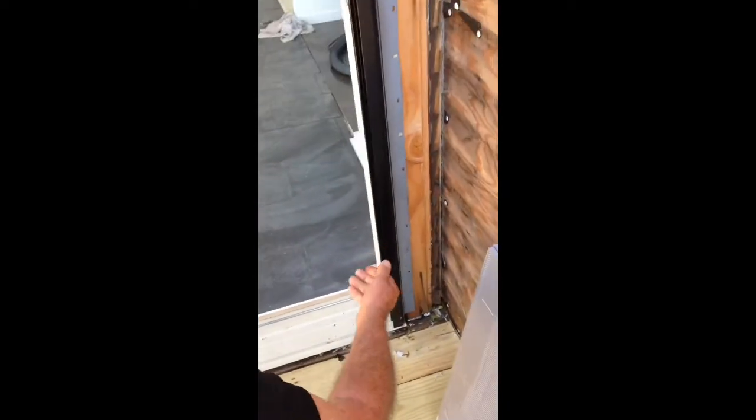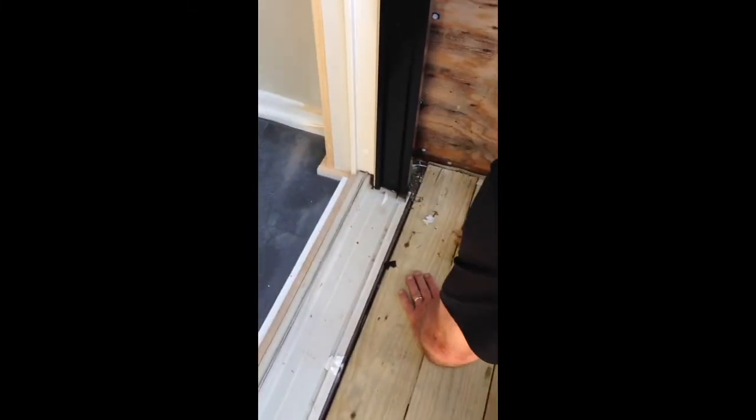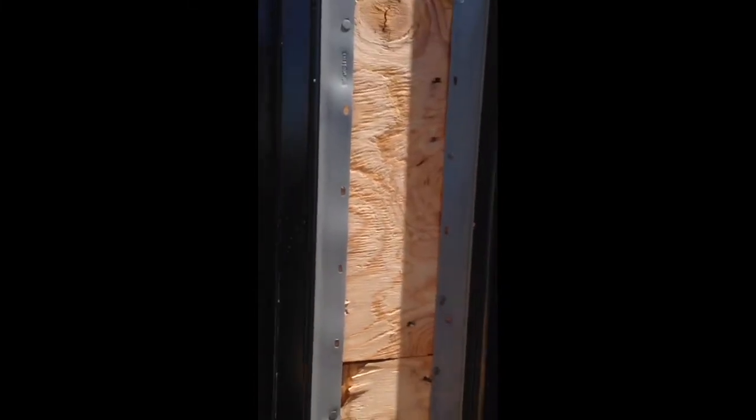There's nothing under this door. There should be a sill pan under there — a piece of aluminum — and it should come up the sides so water can't get in. Any water that transfers around here goes down and out. Just to recap: the framing should have been wrapped first, then the doors go on. What were you saying about up at the corners, at the top?